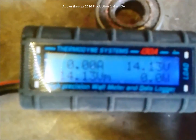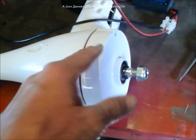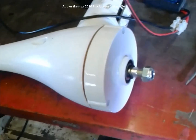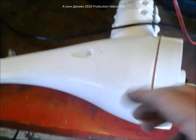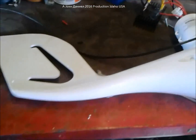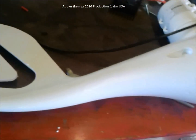It maxed out at 8.85 amps and 126 watts. So is this worth it for a couple hundred bucks — buying this, or three or four of them, versus buying one of those alternator-adapted or washing machine motor-style alternators? Yes, it's worth it. Those open-face units won't last very long — their magnets will eventually chip, get rust in them, and fall apart completely. That meter doesn't lie, and it tells you the unit works.